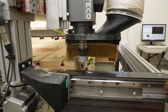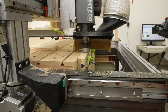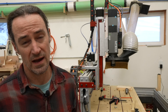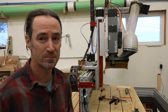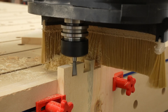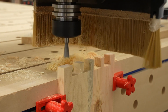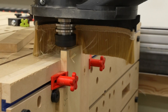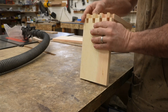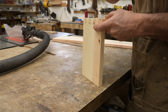I put the two-inch surfacing bit back in the machine and manually jogged to surface the top exactly at my spoil board level. I accidentally went the wrong direction at first and started getting some chip-out, so I had to start again from the other side to avoid that. Then I could finally test it out. I designed a simple dovetail joint in Fusion 360, ran the tool paths and CAM, used a dovetail bit to cut out the tails, and a straight bit to cut out the pins. The straight bit was a little short but everything worked out. With about one thousandths of an inch clearance, the pine wood fit together — a little excessively tight, but it did fit.